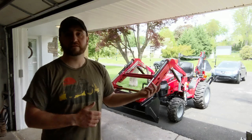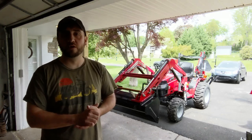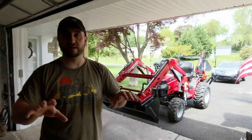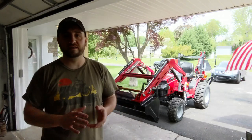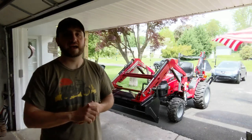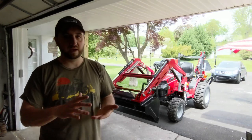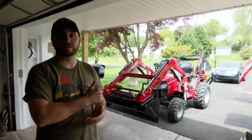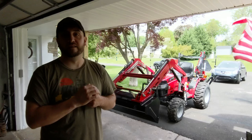And if you look at a factory loader bucket, they always just put weldments right on the bucket. They don't use a full plate and weld it on and all that. It's just unnecessary weight. It doesn't add any strength. It doesn't help you in any way. It just adds weight. So I looked around to find one of these WorkSaver adapters, and they're just far better